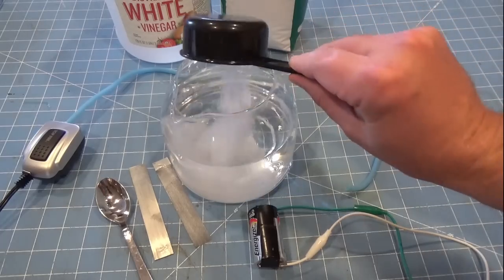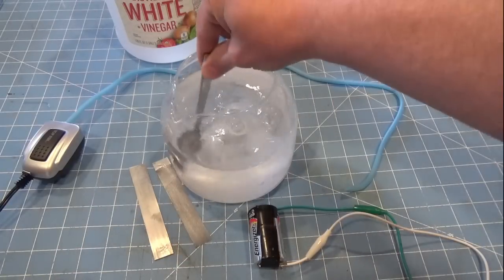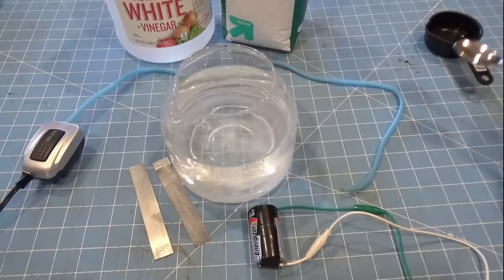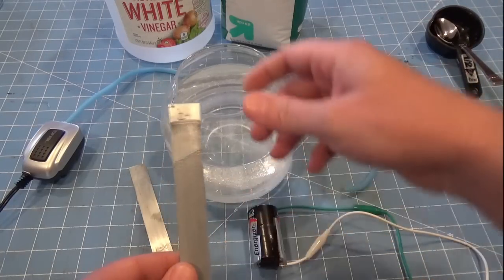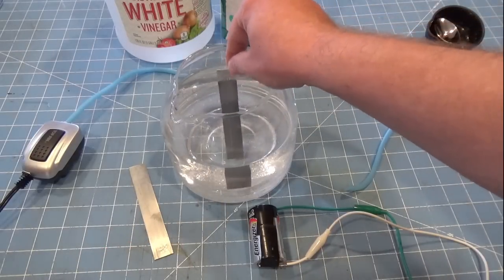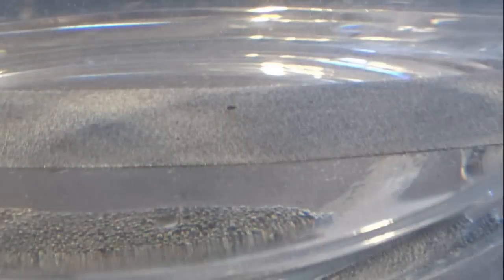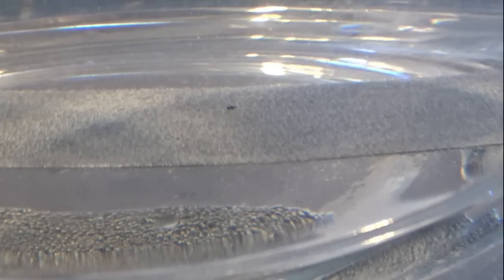To get started, we will pour the salt into the distilled vinegar and mix it with our spoon. After the solution is thoroughly mixed and all the crystals have dissolved, we're going to take one of the zinc electrodes and simply place it in the solution. You'll need to stay here for about four to six hours — you can even go overnight if you like. After a few minutes, you'll notice bubbles forming on the zinc electrode. This is the vinegar attacking the zinc metal and forming zinc acetate. This is the key ingredient in our plating bath and our source for zinc ions. Once we have enough zinc acetate, we can begin plating the car.